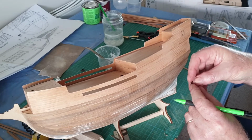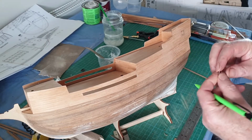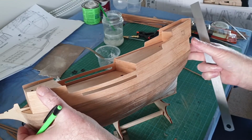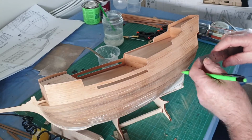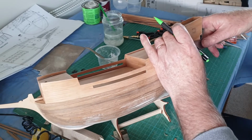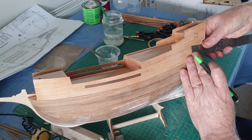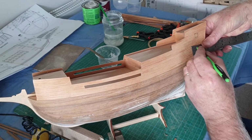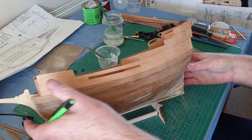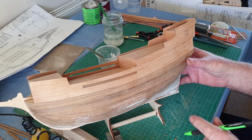And these larger ones, the cutout, the rebate on the back, the cutout is actually 10 millimetres squared. So again, we have to look at this square on. That was the front corner. Bit awkward trying to keep it in line with the camera so you can see what I'm doing. So we'll do the rest of those. We saw previously I drill the corners.